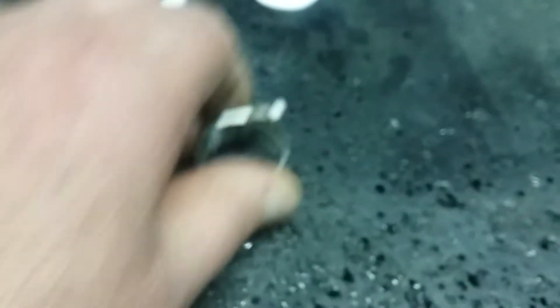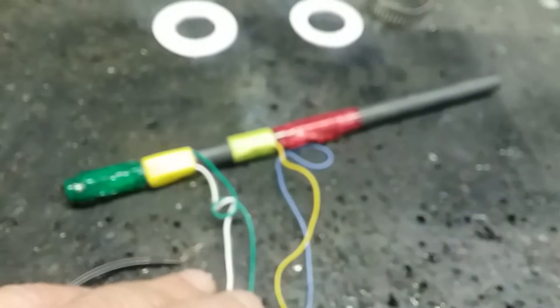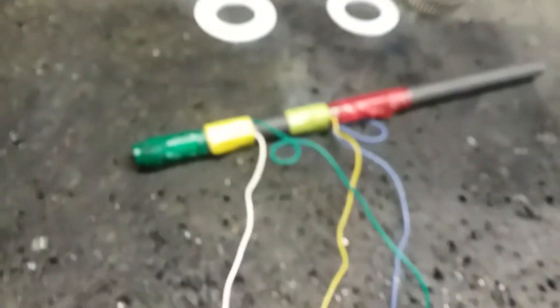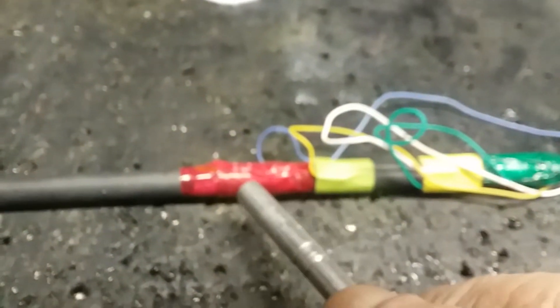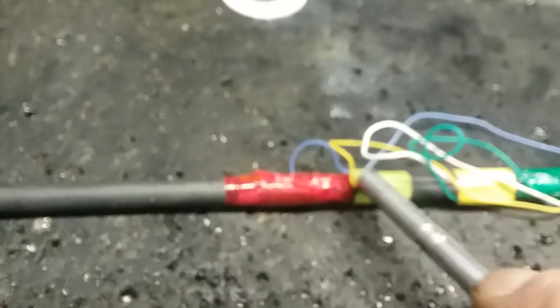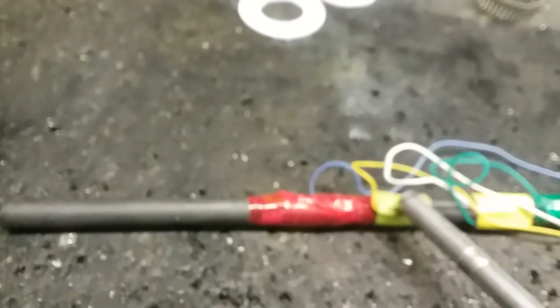Since you last saw it, I've dressed the antenna a little bit. I've got the pickup coil — this is all silicone wire, I wanted some nice flexible stuff. When you're running the wires from the windings, run them over to one side, put a wrap of paper tape on here first. You don't want the raw wire touching the ferrite material. Do the soldering and then put another wrap over it.